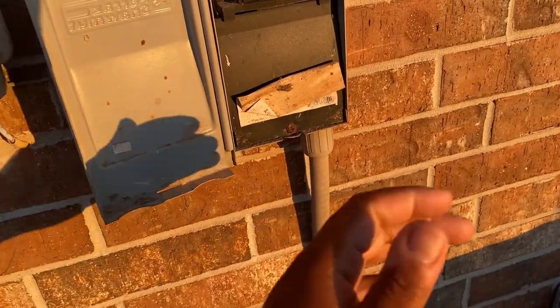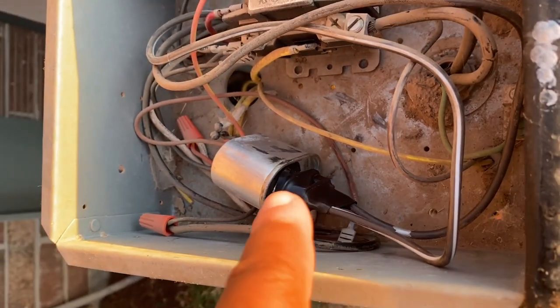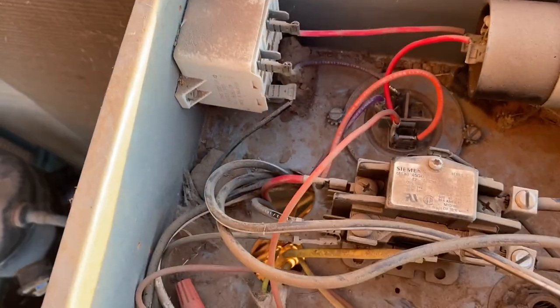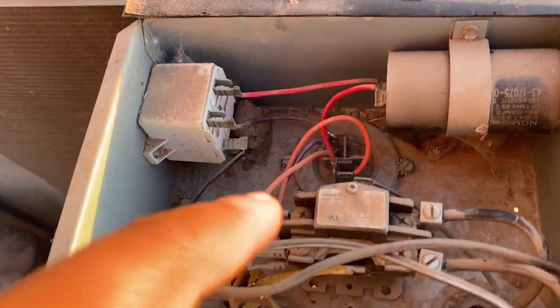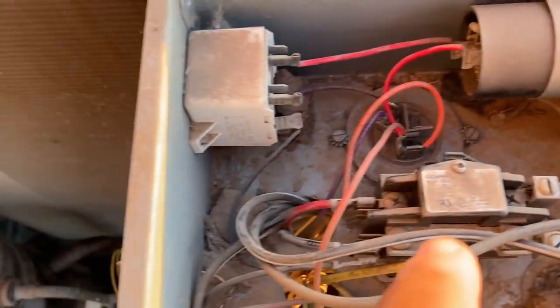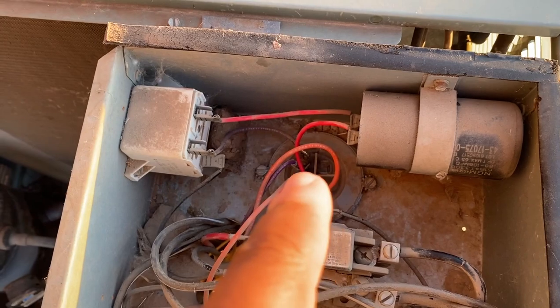Right here I have a single stage capacitor and a dual stage capacitor. That dual stage capacitor pretty much has two screws, or might have a metal strap holding it in. But this one has two screws and you can see it lifts — it's right there. So it lifts, and this is the diagram right there. Once you pull those screws from the top and push it up, pull it up out of there, take a picture and draw a schematic of how the wires are connected on both.